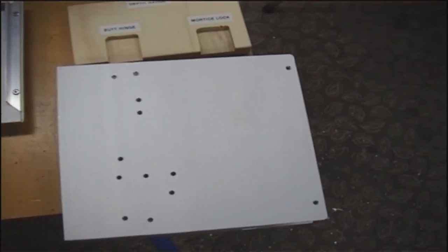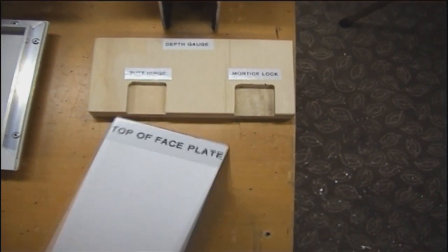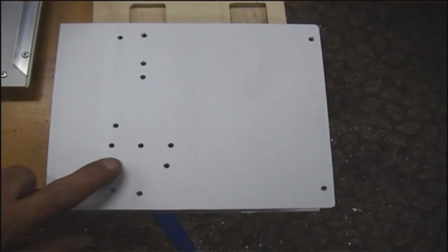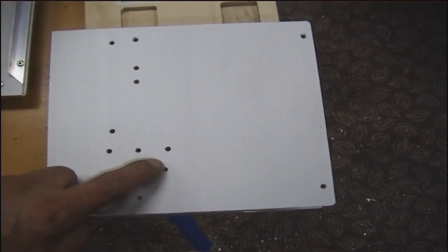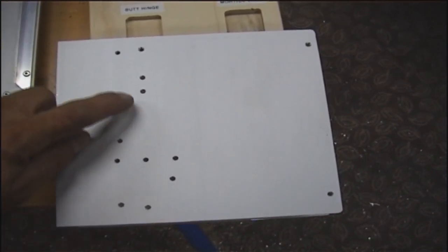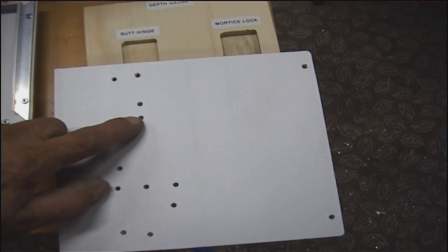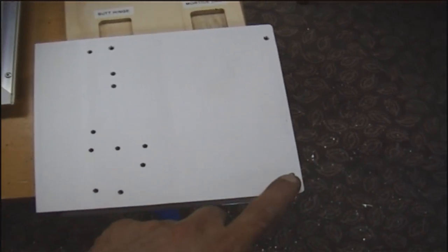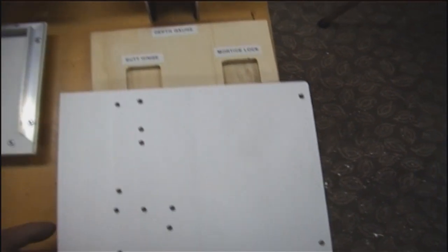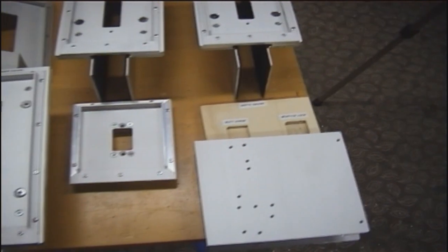I also got a jig here for mortise lock cutouts for timber doors. You can see the top of the faceplate. We've got the centre of the door handle and the screws on either side, horizontal, that hold the handles in. You also got door hardware where you got the doors, handles, screw-ins. You got set out for the turn snib or both four cylinders and also the four screws for plate furniture for Lockwood mortise locks. So that's your complete kit.